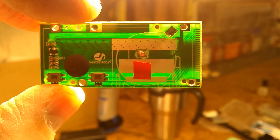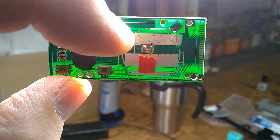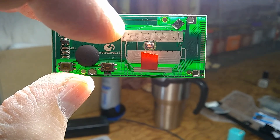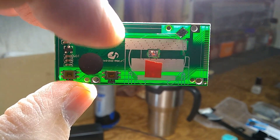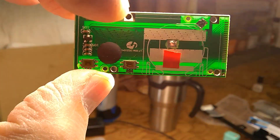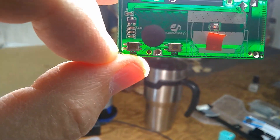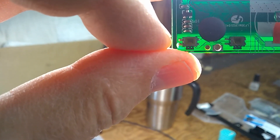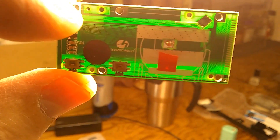I have made four tiny cuts on the printed circuit board. The first three are the contact traces from the negative terminal of the battery, right over the red square — which is a masking tape I'm using to make sure this is isolated. There is a trace running to the right, to the left, and to the bottom, and they are all cut. You can use the tip of an X-Acto knife or Dremel. The other cut is by the switch — between one of the terminals and the main grounding trace.